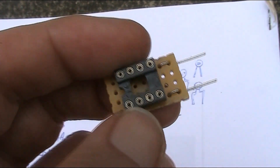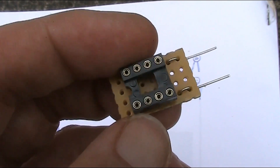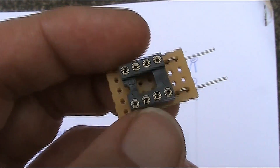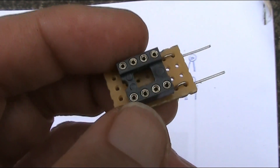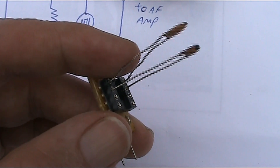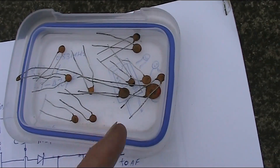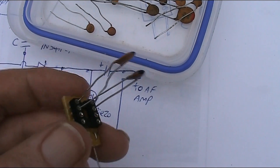If you've got a handful of capacitors with values like 10 picofarad, 22 picofarad, 47, 100 and 220 — if you've got a combination of those, then you can get a wide range of capacitance values. For example, 100 plus 47 gives you 147 picofarad. Make sure both of them are inserted so they're connected in parallel. The capacitors in parallel add in value. This is fairly critical because this will affect what station you're receiving, so make sure you've got a good selection of capacitors. You might want to make up a paper table showing you what values you can get.